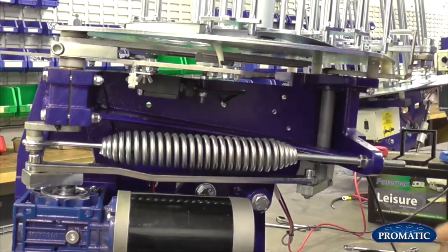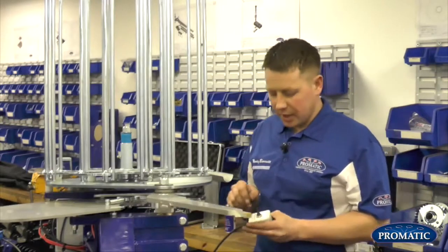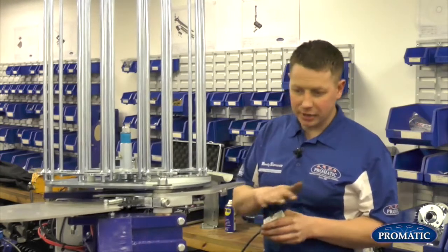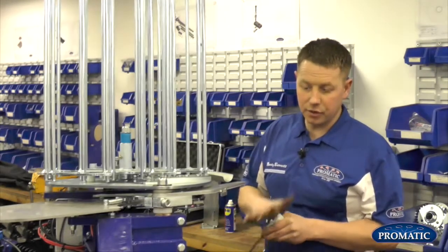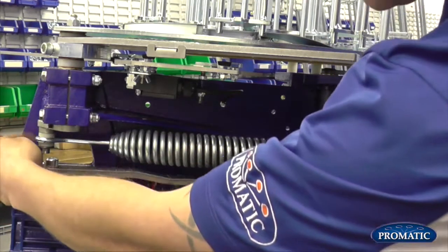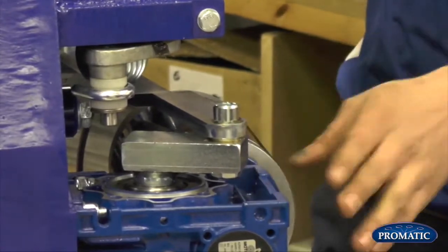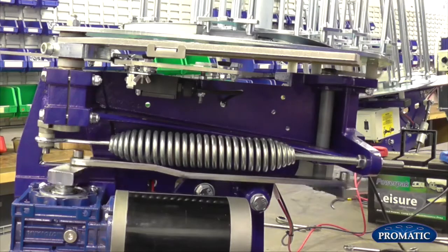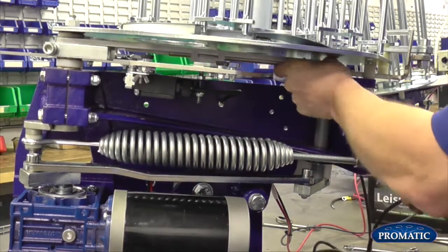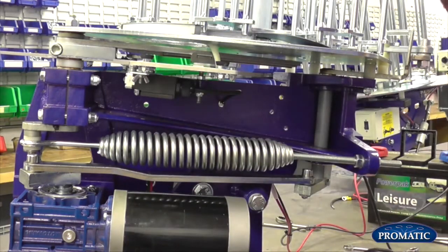It's a perfectly safe position. One of the main problems that can happen is this: if we go to arm load, bring it around, and disarm it, when people nudge it to get it into the 11 o'clock position, they actually go too far. Now, if I was to push that in, the machine would fire, and this pin here would come round and smack onto the drive bolt, which would shear the pin. So if you do go too far, for instance you come into 10 o'clock, don't worry, arm load it again, it comes round, disarm it, 11 o'clock, push your arm in, and then you'll hear your dung. That's perfectly safe. If you do go too far, just repeat the process and go to 11 o'clock.